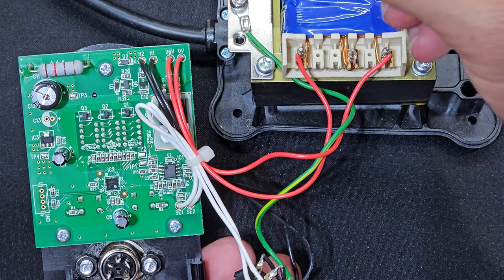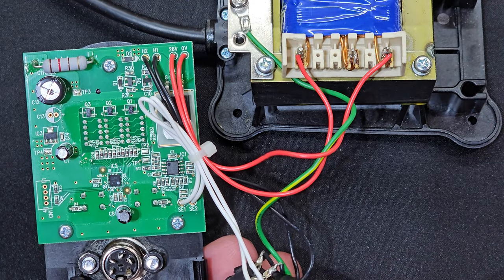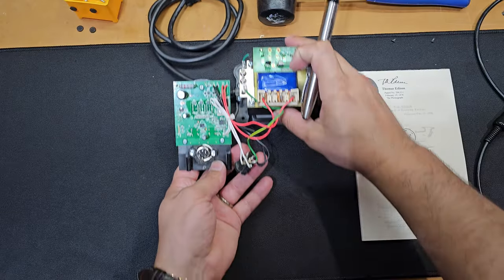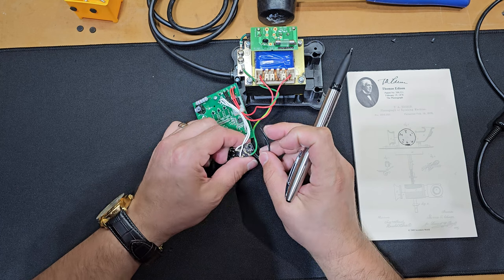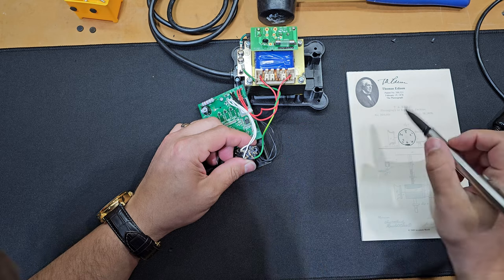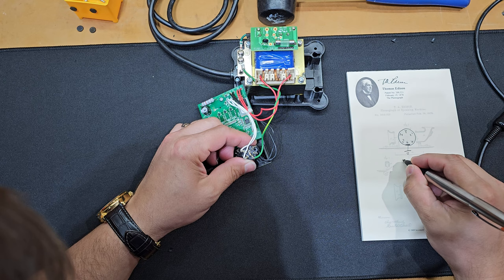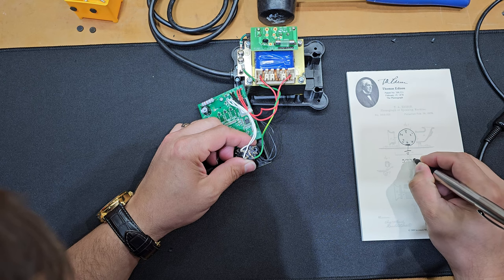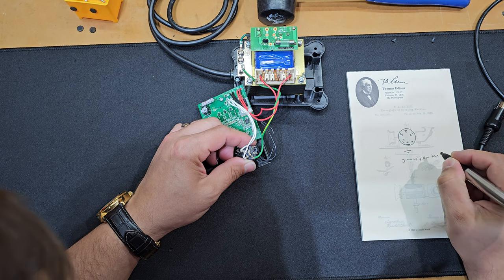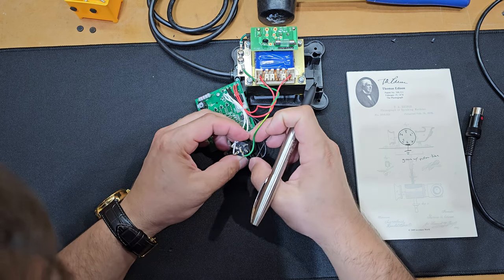This is one of the most important aspects, I think, of any good follow through on projects, especially in engineering when you're looking at diagrams. Be absolutely certain that it follows through 100%. So I'm gonna do it 3 or 4 times where I'm gonna grab the wire and feel all the way across, visually confirm. And then sometimes what I like to do is actually read it backwards, right? So I go, okay, what's my pin? What color should it be? And other times I'll look at the diagram. What does it say?